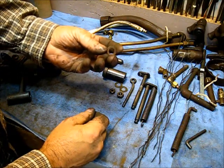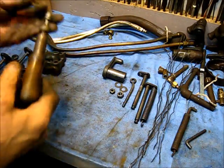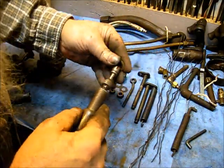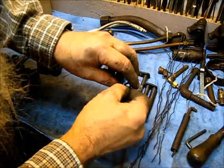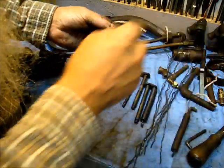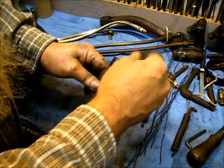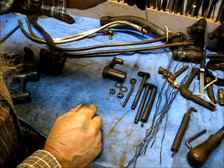There was one spacer washer that did not clean at all — that'll go back in there. A good way to do that is to take a countersink and go right on the inside on both sides. See, you've got that shiny place all the way around there, and that removes the little burr as you go. Now when I put this back in there, I've wired it up tight enough to where that will make electrical contact across there.